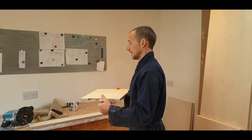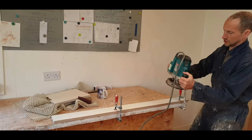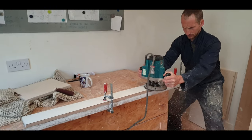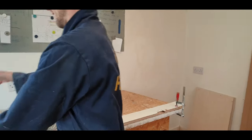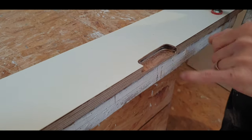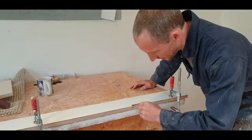We need to test it on a bit of melamine faced birch because the whole wardrobe — all the cheeks and all the doors — are made out of melamine faced birch. I'm just going to plunge it in to see how it reacts and if it chips. You can see it's not a nice light birch colour — we've got a horrible piece come through and it's gone a bit black, it's burnt slightly. But it hasn't chipped out the melamine, which is good, and there's going to be minimal sanding.